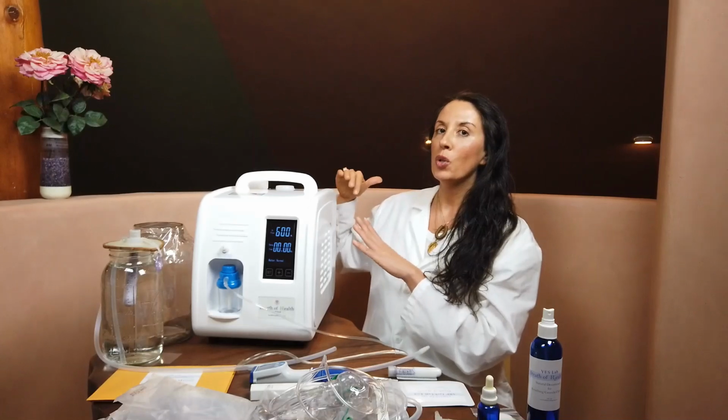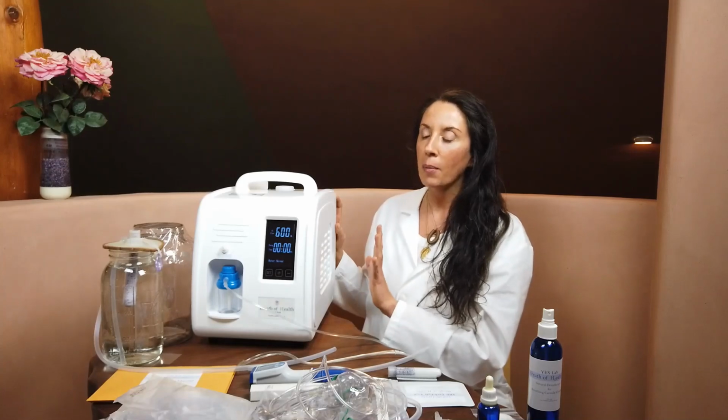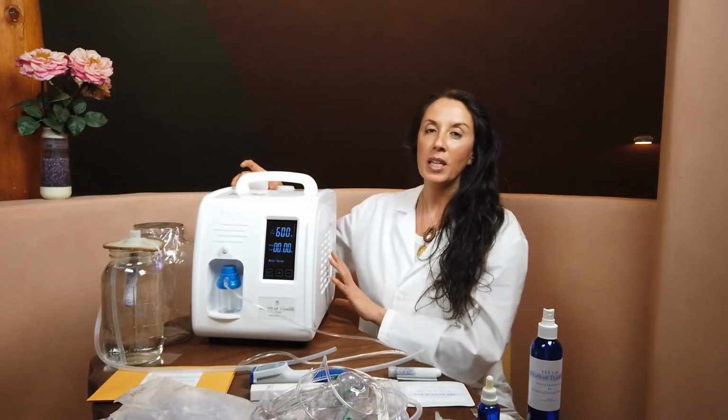So this plastic tank is specifically used to put your water, whether it's deionized water, distilled water, or double distilled water. While it holds that water, the water is used to go through the process of electrolysis within this machine and generate hydrogen through the SPE-PEM membrane, which is another technology. And you don't need to use any type of hydroxide, type of salts like potassium hydroxide or sodium hydroxide. That's actually very outdated technology. So this is the top technology with the SPE-PEM membrane.